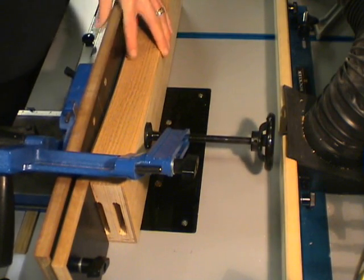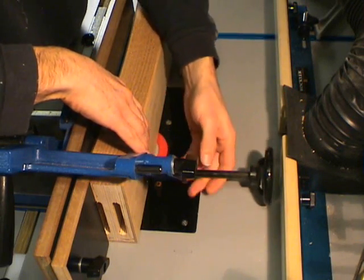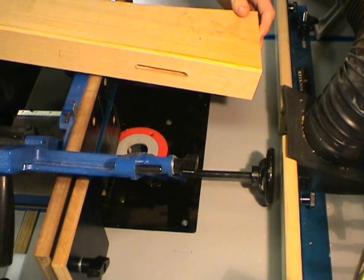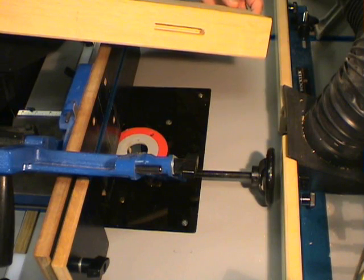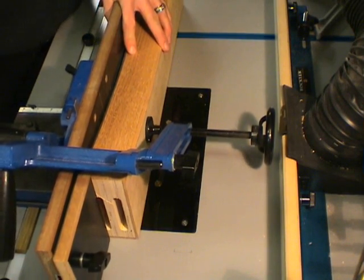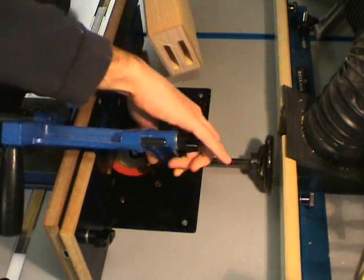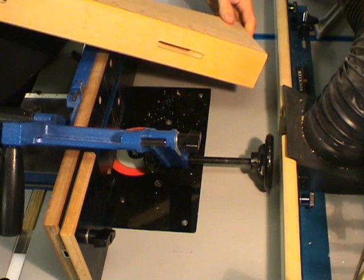These smaller mortises are cut pretty quickly. They're about an inch deep. Having the stop block for reproducible cuts is really handy because now all I have to do is butt the end of the workpiece up against the stop block and make the rest of the cuts. The mortise position, depth, and size are identical every time.